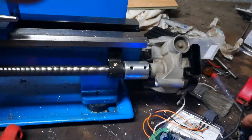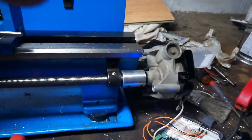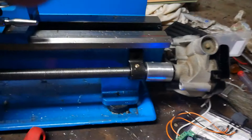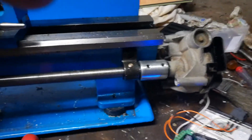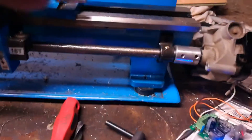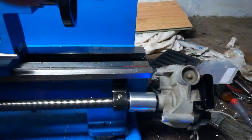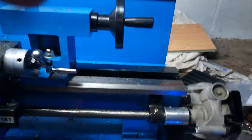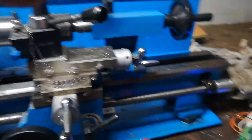I've seen a couple of other videos where people used windshield wiper motors for their lead screws and had it all hooked up to a bracket. I found you don't even really need one. Initially I thought if I didn't put a bracket and connect it somehow to the lathe, it would flip when it goes into reverse. But the weight of the motor is more than enough to hold it in place no matter how big of a cut I take. I've checked it out and it works really good.